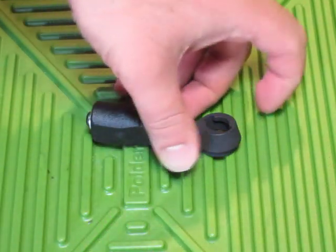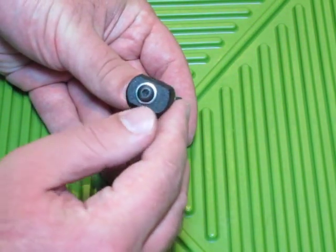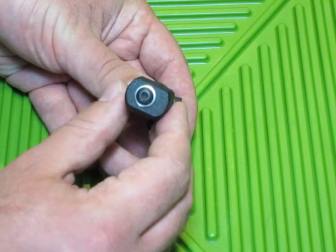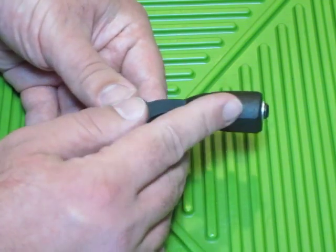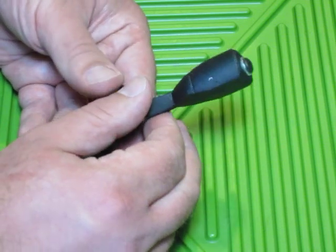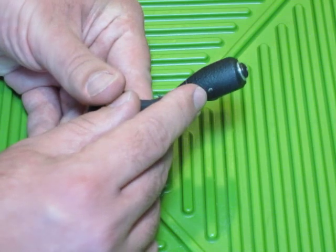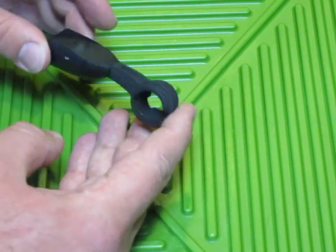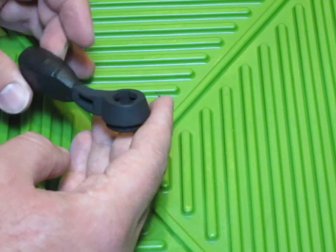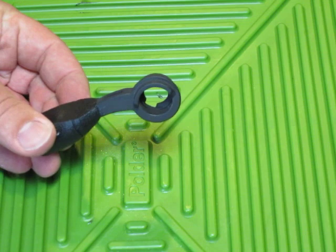Okay, everything's been painted and reassembled. You can see I've got the 10-32 button head screw installed with a washer. I may paint the washer flat black later on. The knob has been painted in truck bed coating, which I found to be pretty durable for this type of application. One little error here where I accidentally left it sitting on some paper before it was officially dry to the touch. The rest of the body has been painted with some flat black high temperature spray paint, and it's just a matter now of reinstalling it on the bolt.